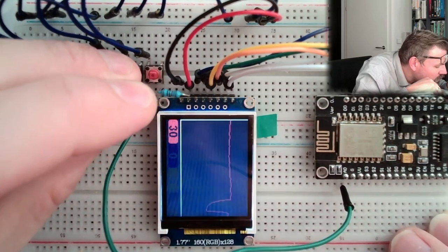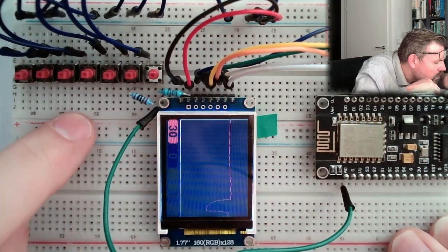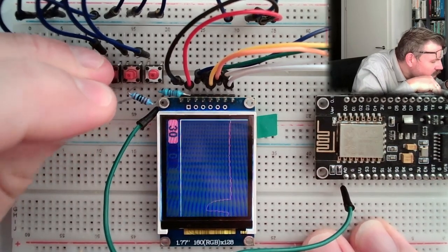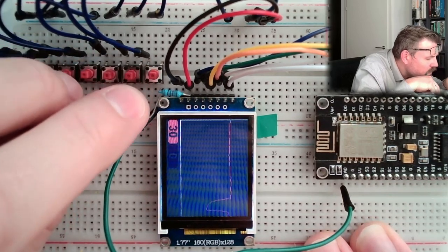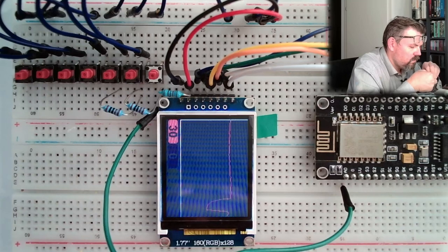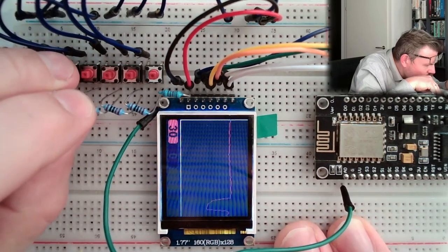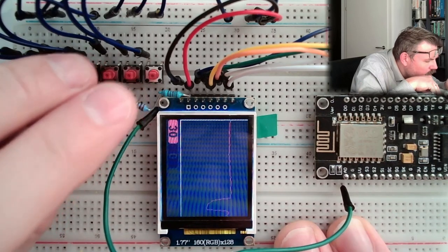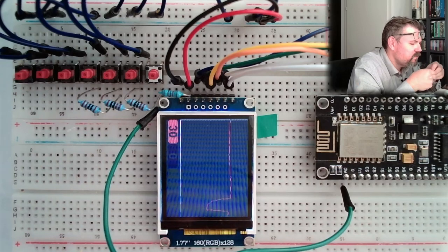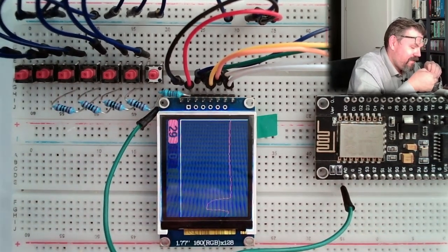So from here, to here, from here. So I need 6 resistors for the 7 buttons, because the last one is 0. Between 6 buttons, there are 6 spaces, right? Between 7 buttons, there are 6 spaces. This would be the correct sentence.